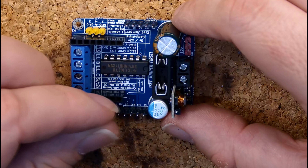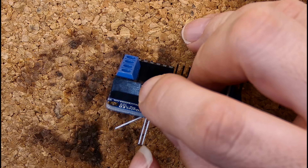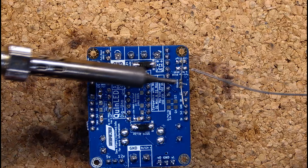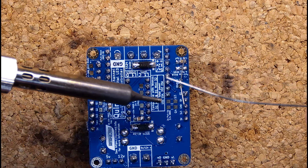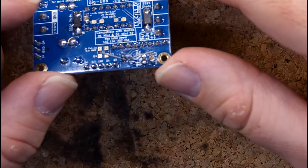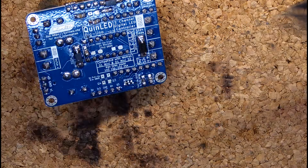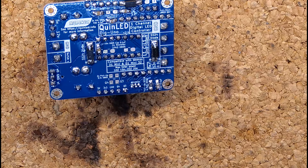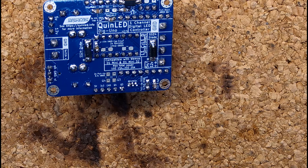Last up is again an optional component, but I like putting them on there — a little temperature sensor. The legs of these are very tiny, but it's fun to be able to read out the temperature. Especially if you're going to be putting a high load on the board, it can be nice to keep an eye on the temperatures, particularly if you're mounting it inside an enclosure. To make 100% sure that the legs aren't crossed at the solder joints, I'm using a magnifying glass with built-in LEDs to check if there really is separation between them.